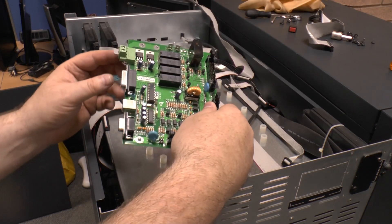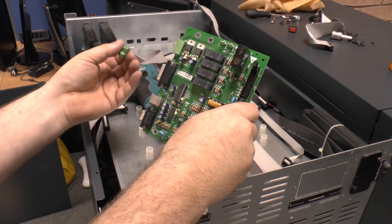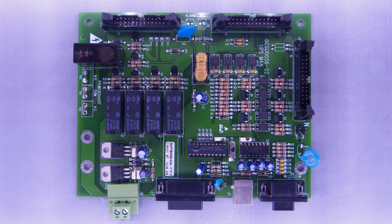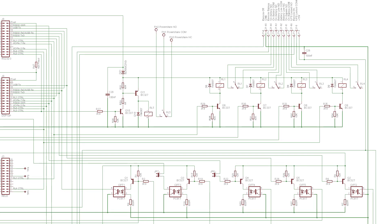The last module on the top is a front panel IO card. It has an emergency power off connection which, if broken, will instantly shut down the UPS, so the connector is screwed into place. Next to that is an AS400 connector with inputs for turning the UPS on, off or on bypass, and relay contacts indicating whether it's on bypass, on battery or if the battery is low. USB and RS232 connections round off the front panel. Internally it has PowerShare relay contacts, used to shed some UPS loads when the battery is low to extend remaining runtime for more critical systems. The main purpose of this board is to provide isolated connections to the outside world, either through relay contacts or through optocouplers.